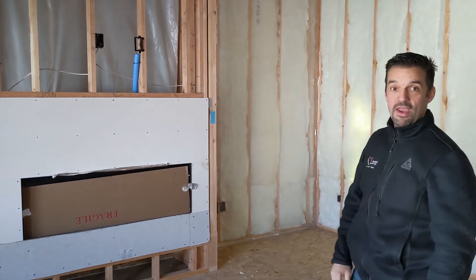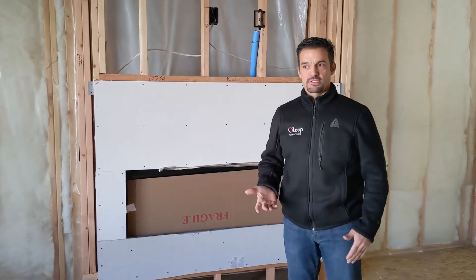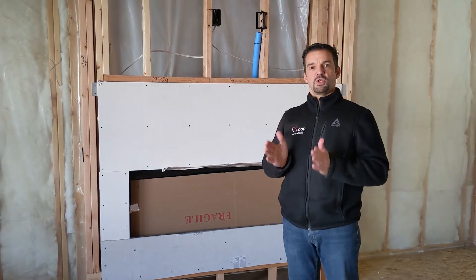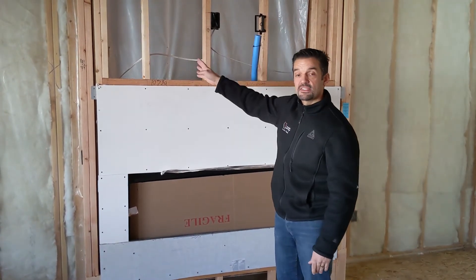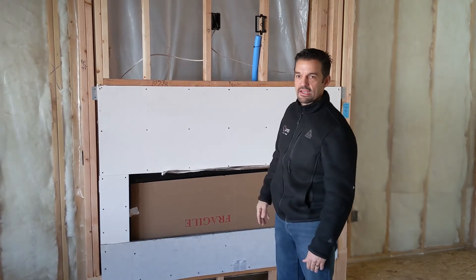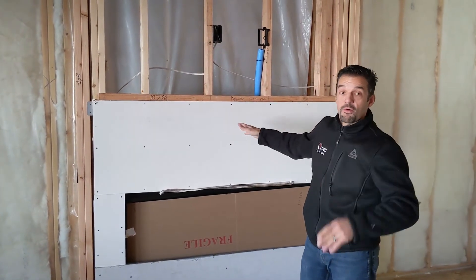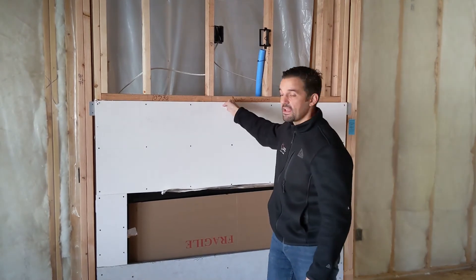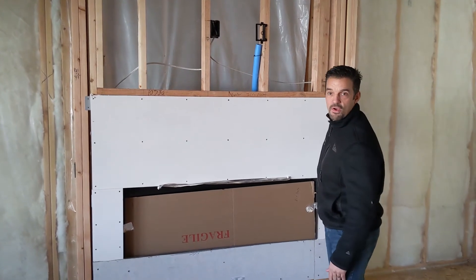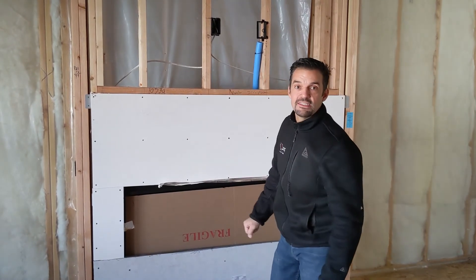For those that don't know, they'll look at this and go, 'Yep, I'm great.' This tip is actually for the builders out there. Here's something you really need to look out for. All TVs and mounts are designed to be mounted 16 inches on center, meaning they need to pick up two studs and those need to be centered. Unfortunately in this situation, the center of the wall is actually not centered on the studs, and not all mounts will allow you to move the TV left or right. So the TV would actually be sitting off-center because they'd have to pick up these two studs. When you're building and doing something like this, you want to pick your center line, go eight inches off each side, find your center line, eight inches off each side, then 16 inches there on. That will give you those two studs 16 inches apart that you need for the TV mount, allowing you to mount that TV dead center on the wall.